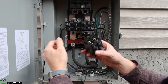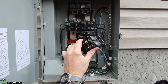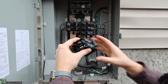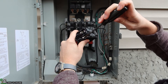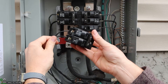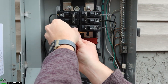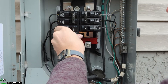Now it's time to move on to the black wires. I've got my breaker — I'm going to place the wire down into one side. It doesn't matter which side you start with; they're both the same. Tighten that down onto the wire. Now move over to the other black wire and place that into the breaker. With those wires in, it's time to get the breaker clicked into position — start like this, fold it over, and press down. Make sure it's made a nice solid connection.